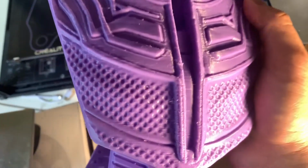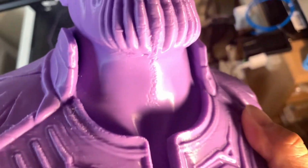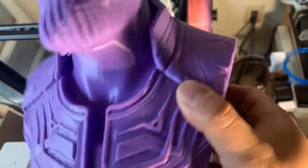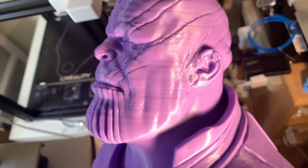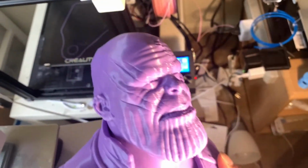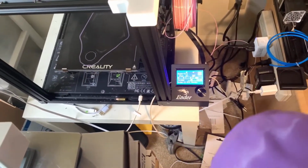Now, I want to ask why I have some weird extrusion issues. Not the Z-seam, but on his face here, those extrusion issues. But here's all flat, really flat. Now this on the side is not great, but you can see how flat and consistent that is. But the side of his head, you can see there's little lines here and there. I wonder if that's from a wobble as it got higher up, even though this should be keeping it from happening as much. This little cheap IKEA table may not be enough. May need to get a concrete paver. Still, I am confused.